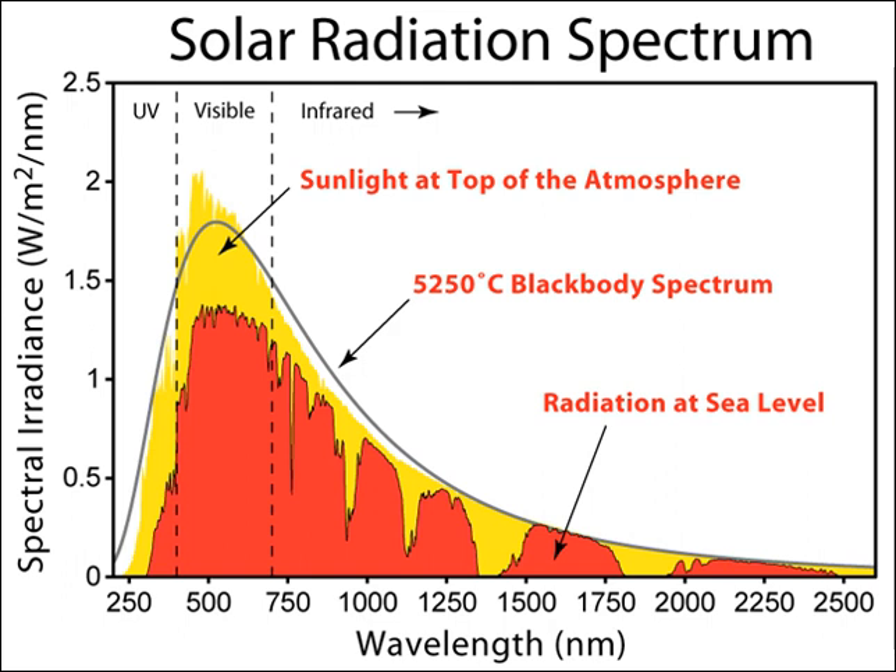Based on antenna theory, an optical antenna can absorb any wavelength of light efficiently provided that the size of the antenna is optimized for that specific wavelength. Ideally, antennas would be used to absorb light at wavelengths between 0.4 and 1.6 micrometers, because these wavelengths have higher energy than far-infrared longer wavelengths and make up about 85% of the solar radiation spectrum.